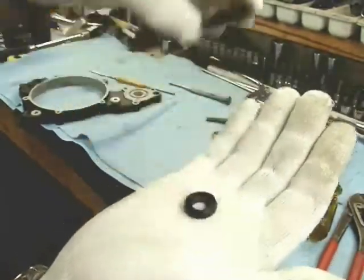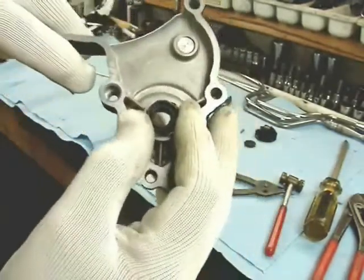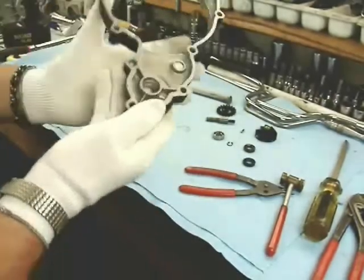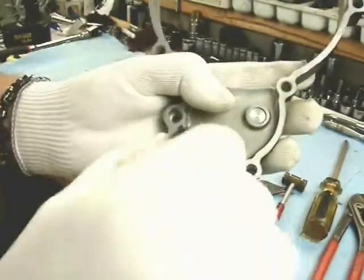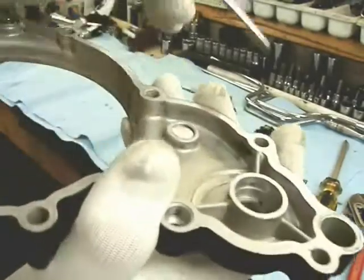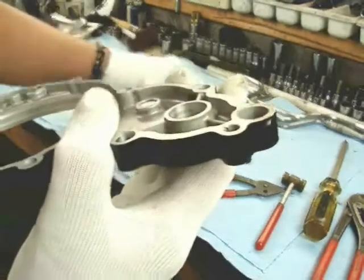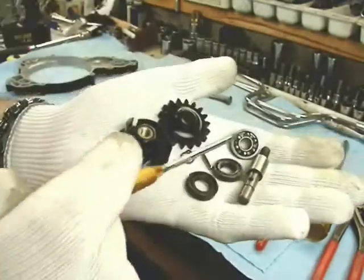The gear and the impeller are the first things above each seal. The inner seal drops down in there — you can't put it in wrong other than having it reversed. Following that is a slightly larger step where the bearing goes. The difference in machining shows a larger area on top because the bearing has a larger outside diameter than the seal. So the seal goes in first and seats against an inner center lip, then the bearing goes in.